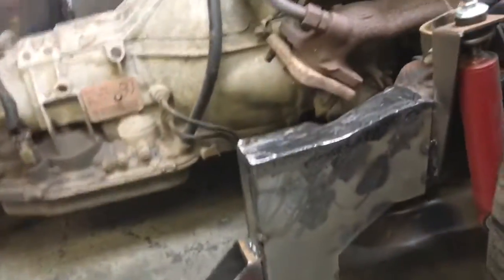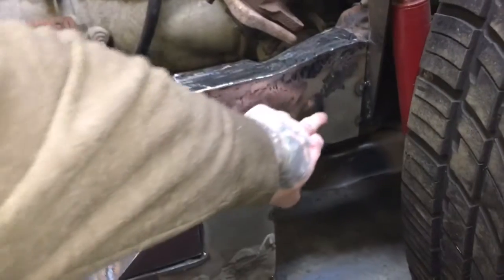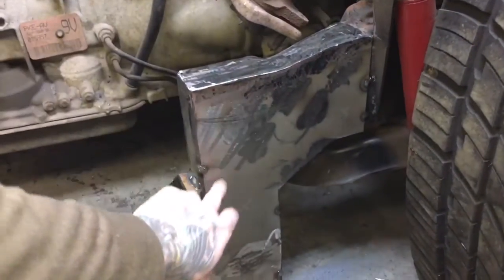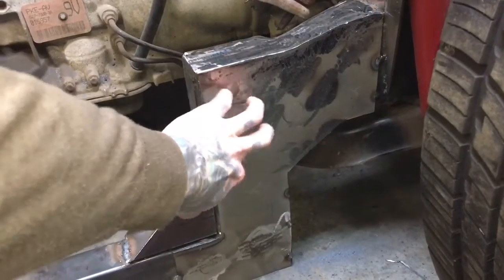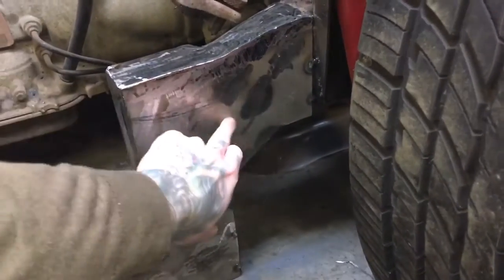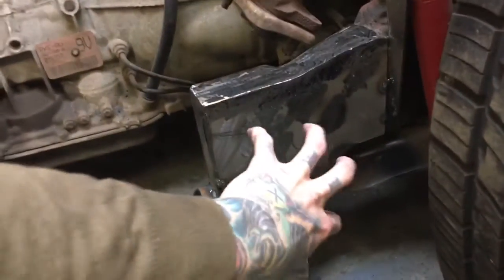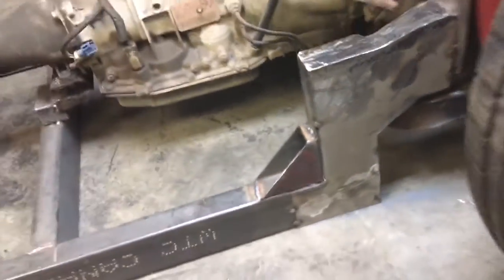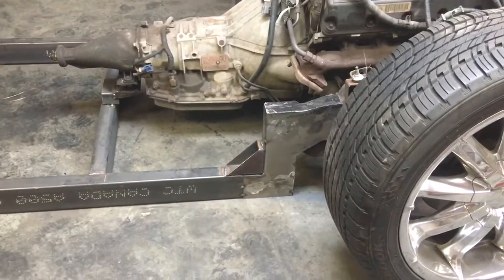That's the surprise I got done today. Through all these pieces I drilled plug holes — you can see one X right there — I drilled a bunch of plug holes and then welded them solid. The inside of this plate was welded to the backside of both of these, so it's welded all through here — all these plug holes, all these marks — pretty big plug holes. It's in there pretty solid. Pretty happy with the outcome; it looks pretty good to me.